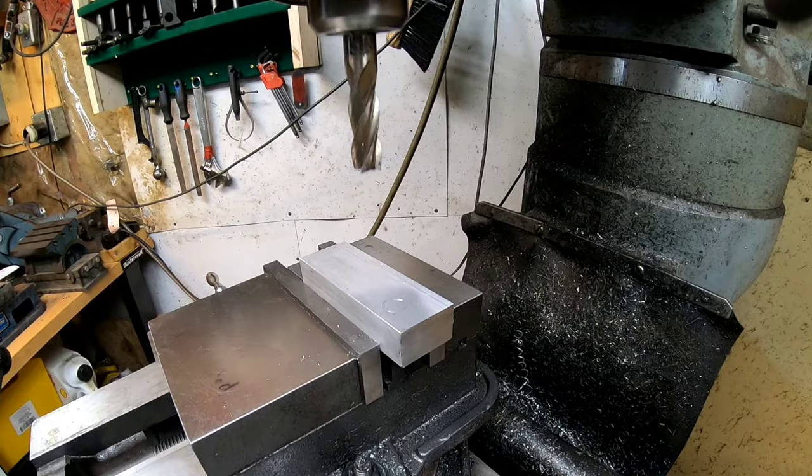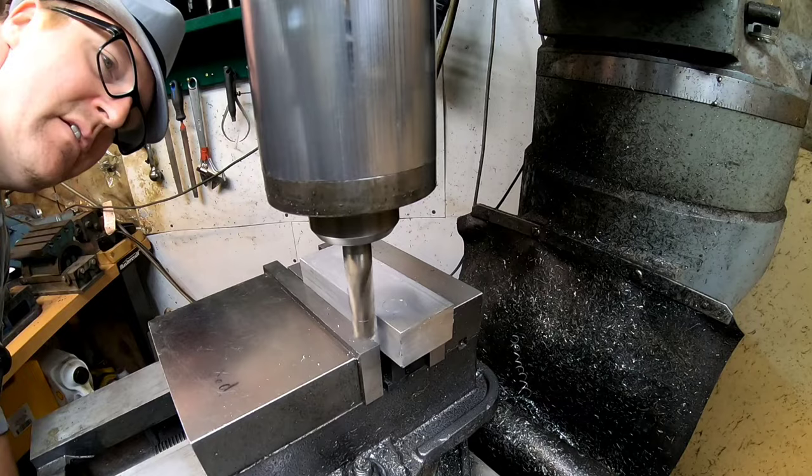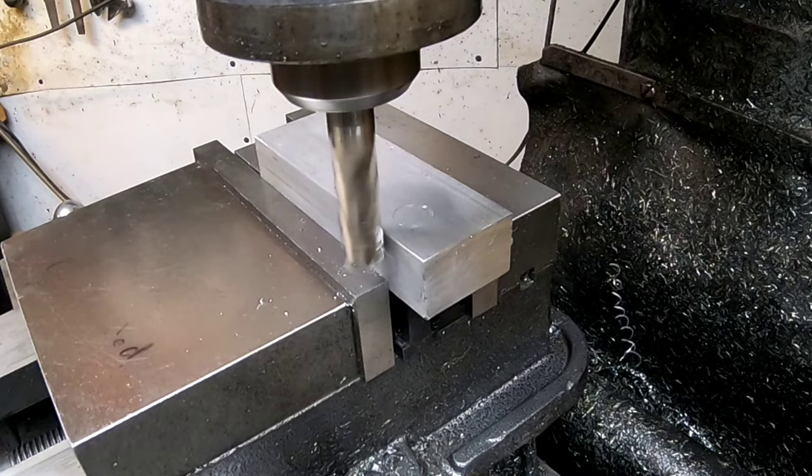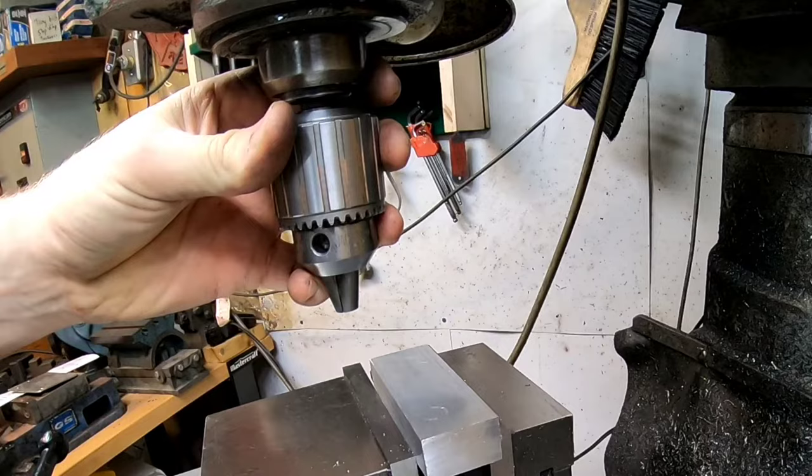Inversely, we can do the same technique on the side. It's going to leave a little cut no matter how hard you try, because the idea is you gently feed it in until you can see it cutting away a little bit of material — and hopefully you've only gone maybe two or three thou into the work.